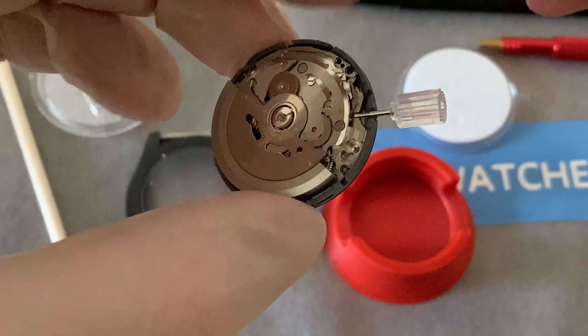Now, crown. We do need to install the crown. Kindly, Namoki have actually cut the crown stem for us. If they keep doing this with all of their cases, that would be a great help, because that does take a bit of effort - sometimes you could cut five of them before you get it right. You'll see some others suggesting to use Loctite or some sort of thread locker, but I don't do that anymore. If you can tighten it well, it's really unlikely that the crown will ever unscrew. I've made hundreds of watches now with the same method and it always works.